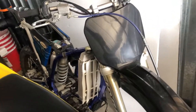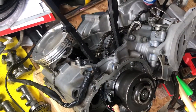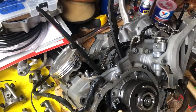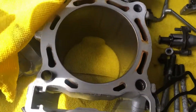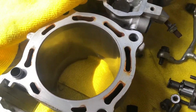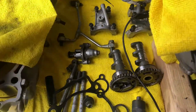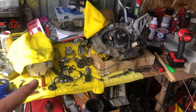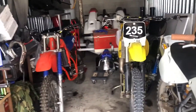The current project right now is this guy we're working on. When it comes to the bikes, we have an '04 YZ 450F — we have it fully taken apart right now. It's got a nice clean piston in it and the cylinder also looks pretty good, a little bit of wear vertically but some pretty decent cross-hatching. The valves are super minty, so just waiting on some parts. We might have a video of a reassembly and firing.